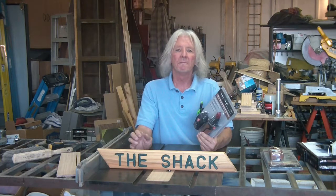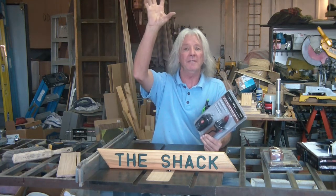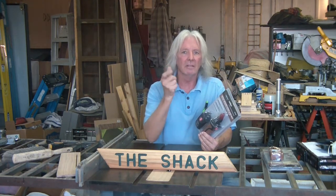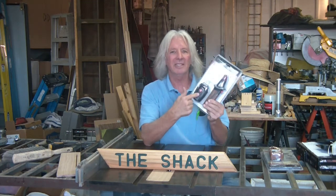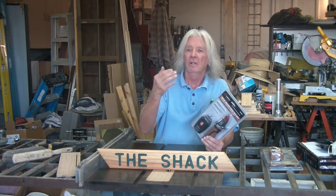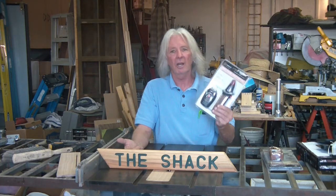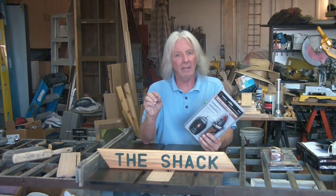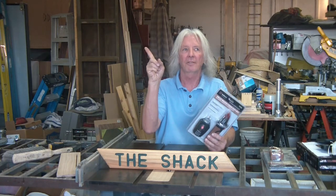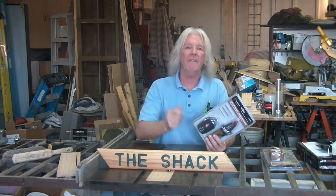Very, very vital to have. Also, if you get a little adapter that screws into a light bulb outlet — especially if you have a ceiling fan with lights on it or just a light up there — you can screw that little plug in that has a three-prong inlet in it, plug this into that, turn it on, go to the panel, and you can go room to room again and make sure what breaker runs that light. I will have a link to a video using these Southwire tools on that project.